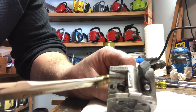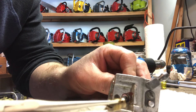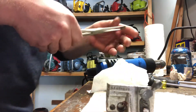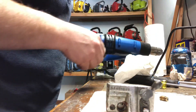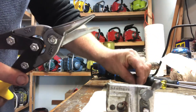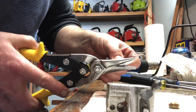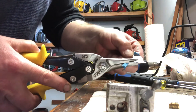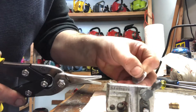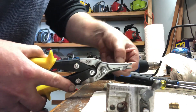So what we're going to do — now that we've got that thing out — is take a little piece of tin that's the same size as the inside of that. I'm going to leave the little brass washer in there. I'm going to cut a little piece of tin from a pop can, something really thin, about the same size as the end of that thing. It's a bit of trial and error to get it right. Just use little tin snips, go around, make a big circle, and keep making it smaller.